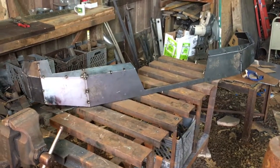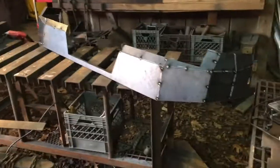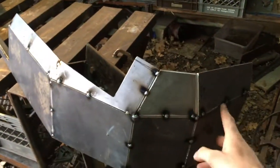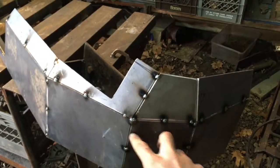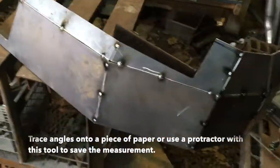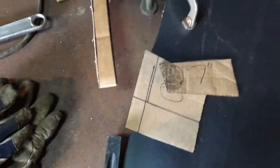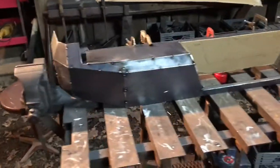Here's the current state of the bumper — I'll walk you guys through it. I have all the side pieces done for the most part. I pulled it off the bumper once I had things figured out, tacked up these two pieces on the truck, then used an angle finder — one of these basic bendable ones — to get the angle and duplicate it on each side. Then I emulated those four pieces on the other side. I'm saving all my pieces so I can package them up and never have to redo this.